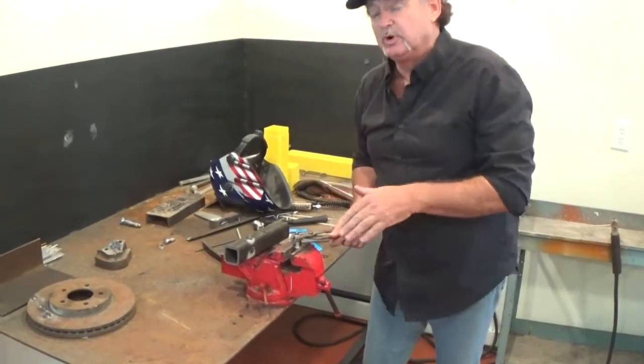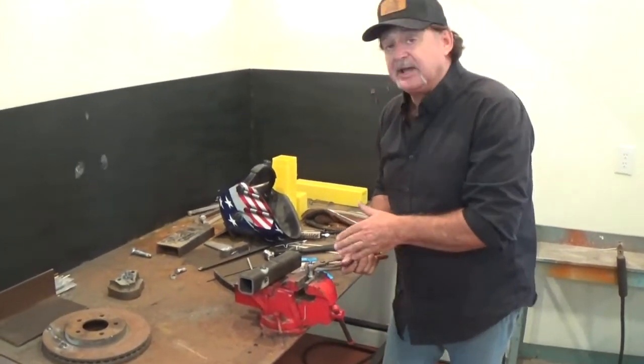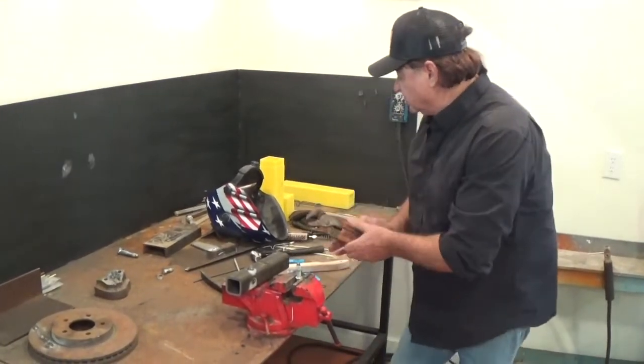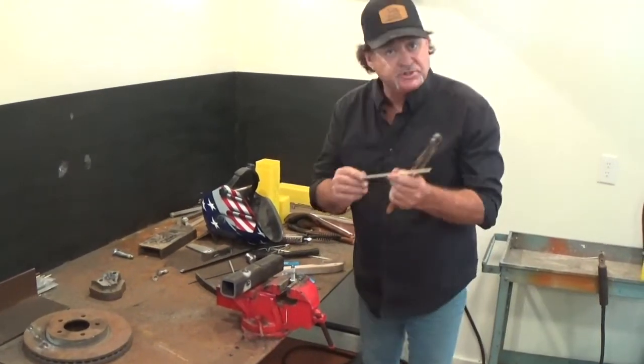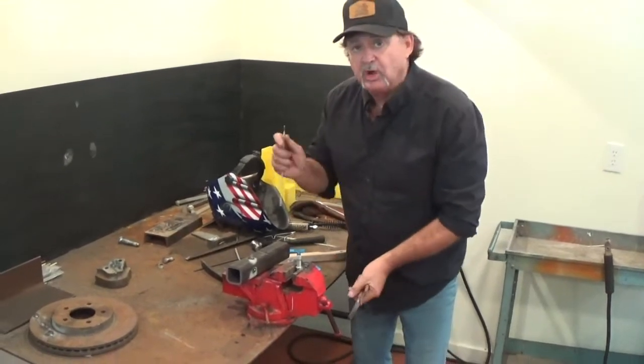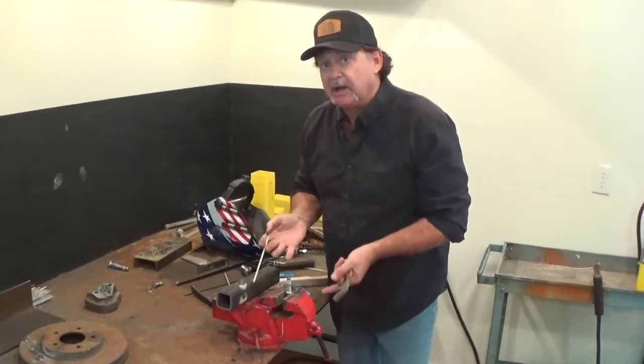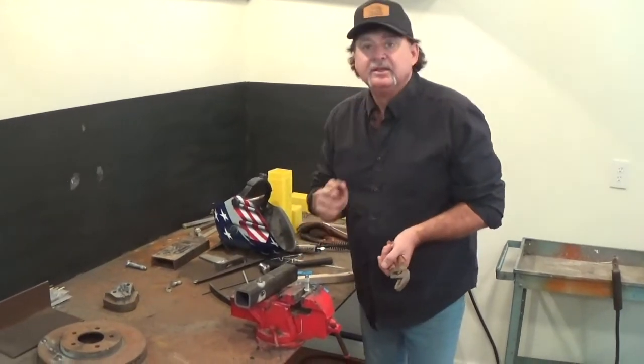Kind of a quick and easy method. You can't always get to them with an easy out. And you'll find that a lot of times you can take a tap — it'll shatter into four pieces. When we go to use this nickel-chrome-vanadium, which welds all steel, we'll go ahead and actually weld that tap back into one piece, and a lot of times you can get that completely straight out and back out of the threads. Thank you for watching.